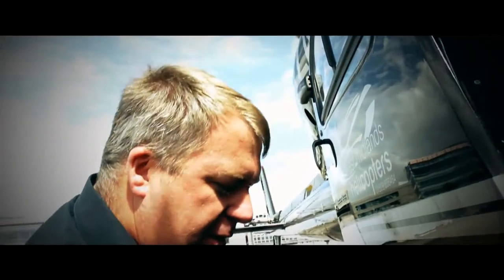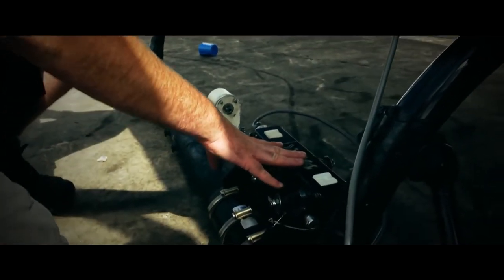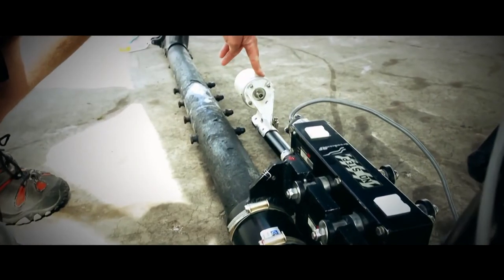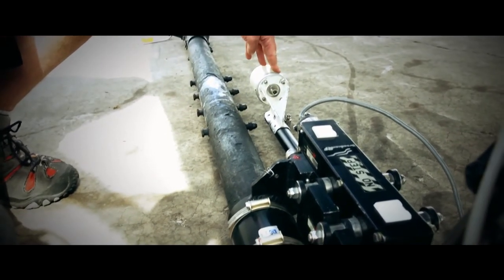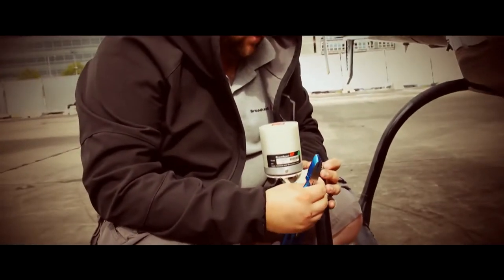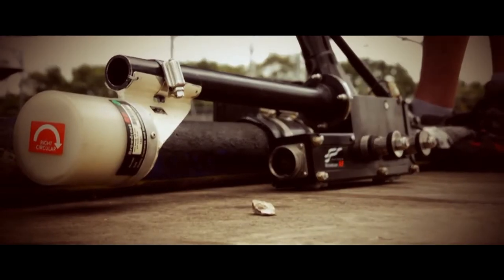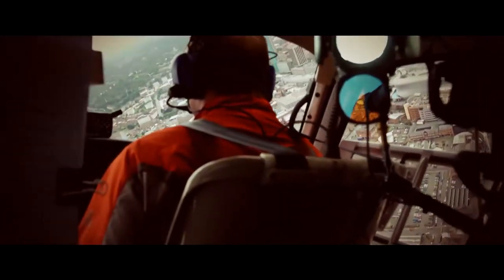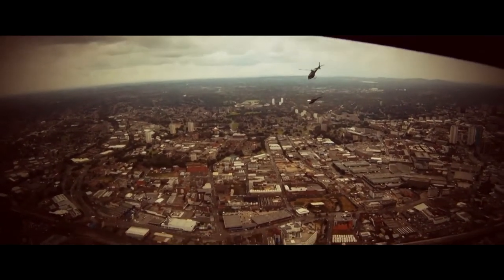The cable comes out the door, down to the skid, and into the actuator on the helicopter. Basically the end bit is our antenna — that's the bit that actually transmits the signal down to the ground. When the heli's in the air, the actuator drops down a good metre or so below the aircraft so the antenna is clear of the body of the aircraft. This means that as the helicopter banks and turns, the antenna always stays the lowest part of the aircraft.